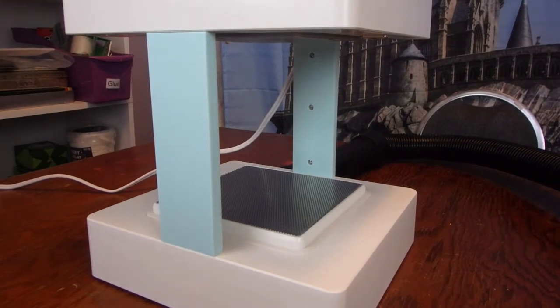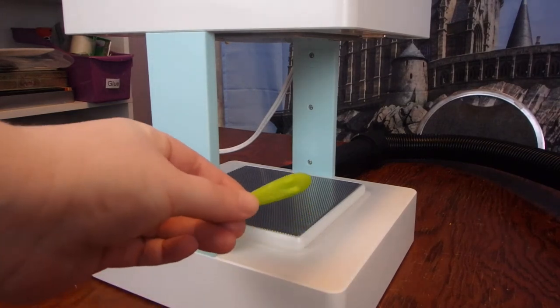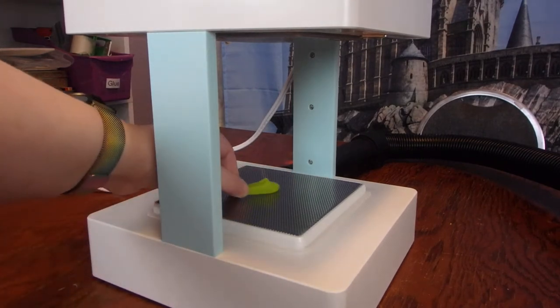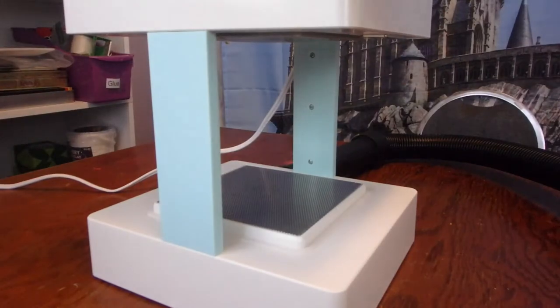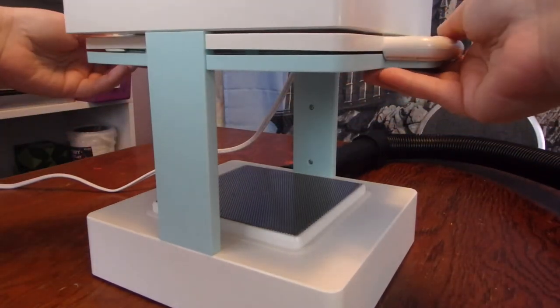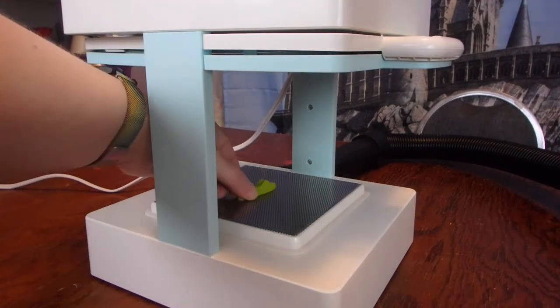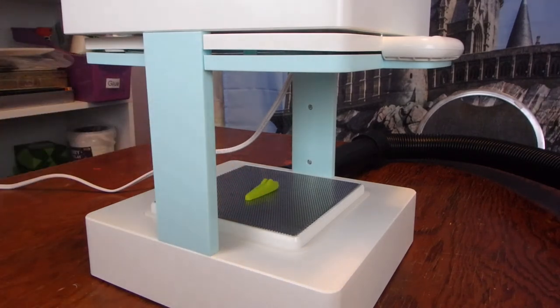The machine's all warmed up. I'm trying to get a camera angle where you guys can see up under there — it's really dark so it's kind of hard to shoot. I'm going to be molding this little tiny piece of candy. We're going to make sure first of all that we put it in the very center of the bottom platform, and then we're just going to wait for this plastic to melt. We're not going to let it droop down like an inch like the instruction manual says. I just want it to get started to melt and then mold it, because with smaller objects you don't need all that droop — I think that's what was causing all of the wrinkles.